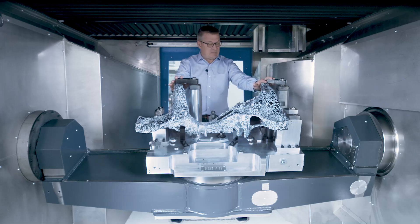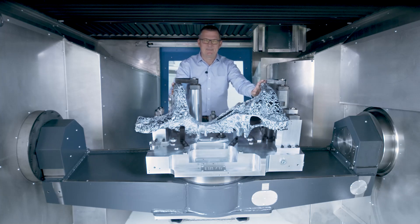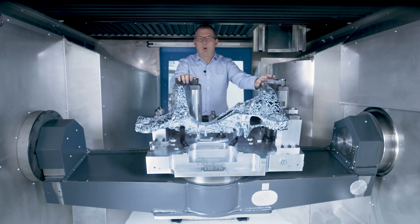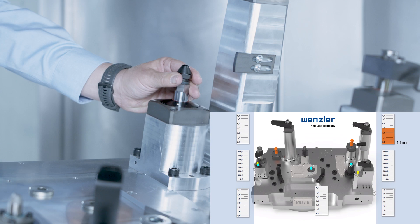This component here is typical. Its shape asks for four-point support, but of course the rules of physics will require a three-point support. So how do they do this? They actually use a rocker, which is integrated into this fixture. And this rocker will be clamped as soon as the alignment of the workpiece is done.